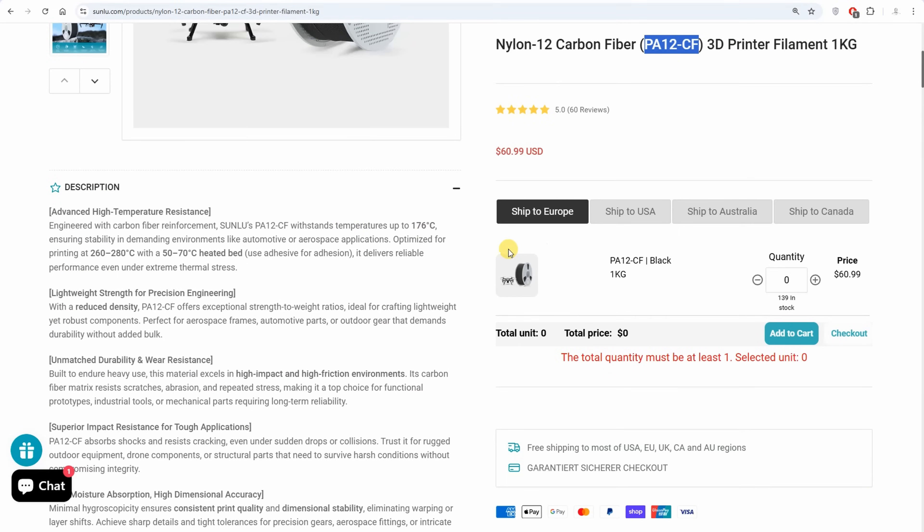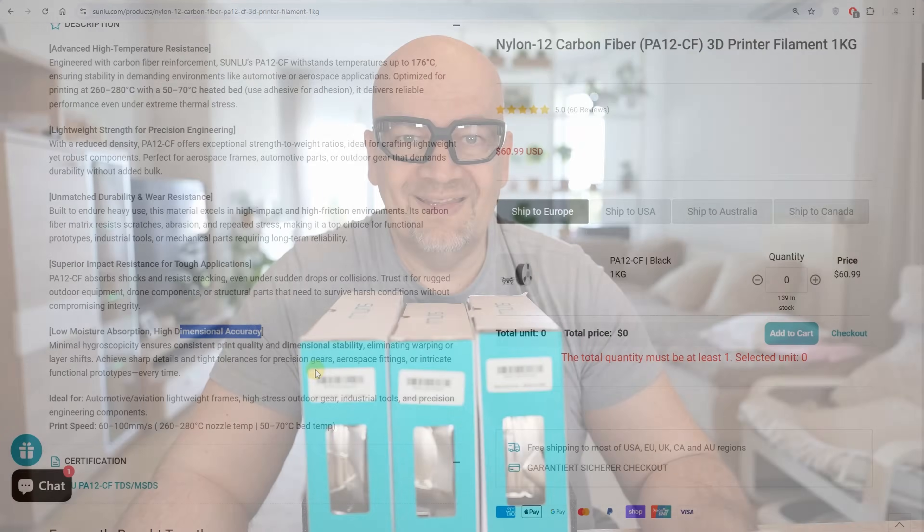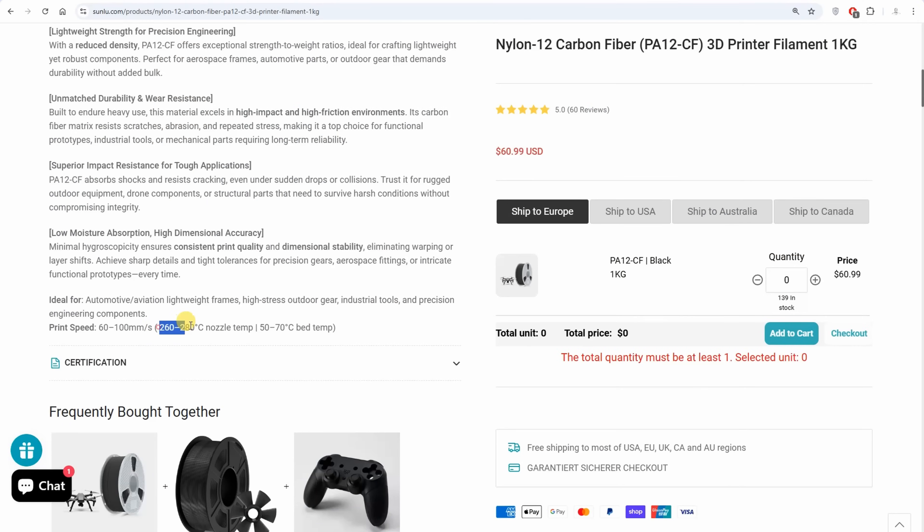About PA12 CF: it is also carbon fiber reinforced and PA12 is less sensitive to moisture compared to PA6. Specifications from the website: heat resistant up to 176 degrees Celsius, small density, wear resistant, tough, low moisture absorption, and high dimensional accuracy. This matches my experience — the fibers really help with dimensional accuracy and we have less shrinking. Nozzle temperature between 260 and 280 degrees Celsius, speed up to 100 mm/s, bed between 50 and 70 degrees Celsius. I couldn't find information about annealing, but I will do the same annealing test, mostly for the creep temperature test, layer adhesion, and bending test to see how much shrinking occurs.